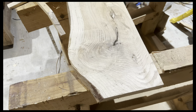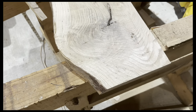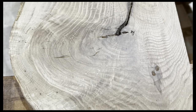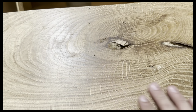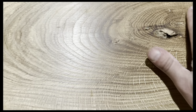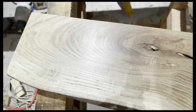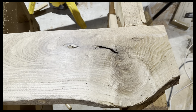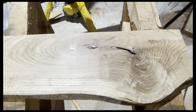Here's the white oak game day charcuterie board after the planer. You can see the grain — this is a limb here with swirls, really nice. There's some end grain from a limb as well. Now we're going to sand this thing off and get to the last step, which is the most important. On the sanding, we're going to go from 120 up to 220, maybe 300.